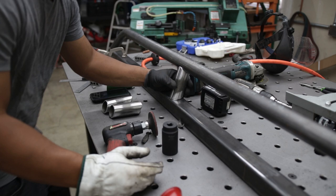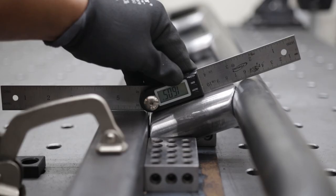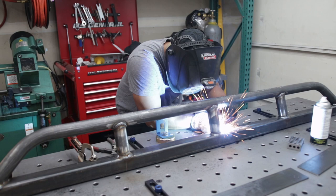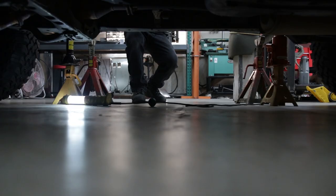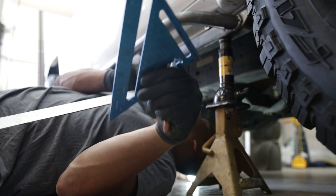After the tubes were prepped, it was time to line them up for tacking. I slid a piece of 1/8 inch thick plate underneath to get the one and three-quarter inch round tube centered to the 2x2 square tube, then used my digital protractor to check if they were at the 20 degree kick up. Since I wanted it to look good, I made a series of tacks to go for that diamond look. Because things tend to warp, I decided to do another fit up to get the final distance measurements from the frame to the slider before cutting my main tube legs.